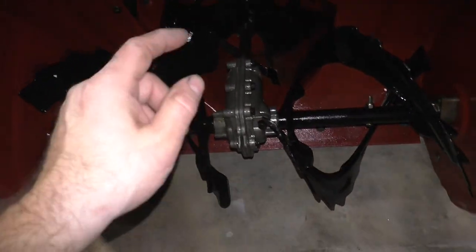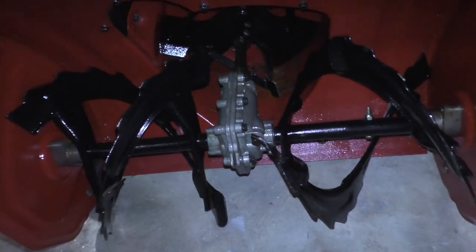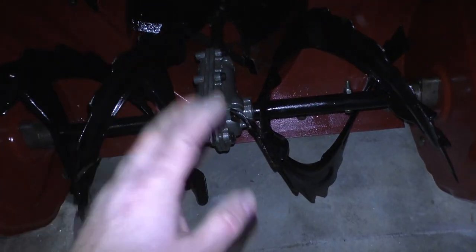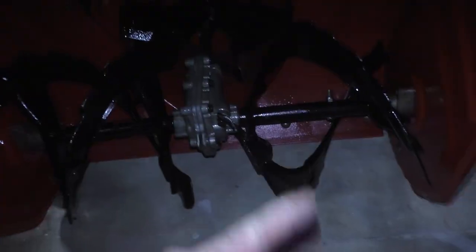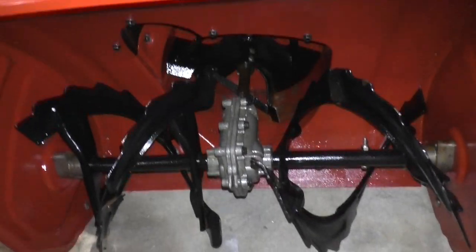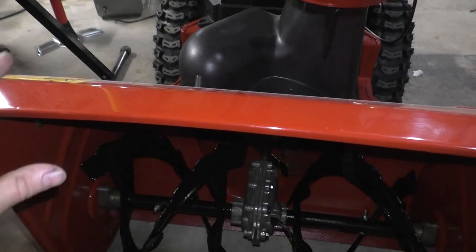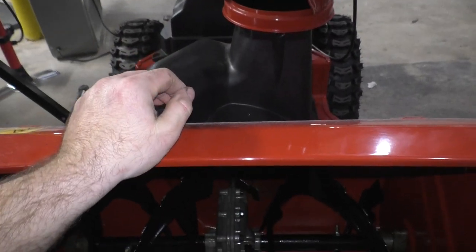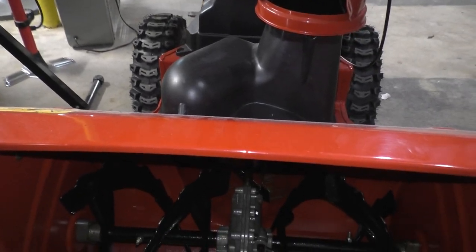As far as I know, I don't think there's an oil change interval in this gearbox — I think it might actually be full of grease. Two issues to watch out for if you've got one of the MTD machines: on the power steering models there is a plastic gearbox in the middle lower part of the machine — that plastic gearbox is a transmission with clutches and a lot of gears, and those wear out very quickly, often after two or three seasons, and they go to hell. They cost more than the entire snowblower to repair. The gearbox is made by General Transmission — who also makes the gearboxes in the Toro lawnmowers — and it's a major weak spot. Also on MTD machines, there are brass gears in the box full of grease with no service interval, and those soft brass gears do wear out — again, paying somebody to replace that gearbox will cost you more than the machine is worth.